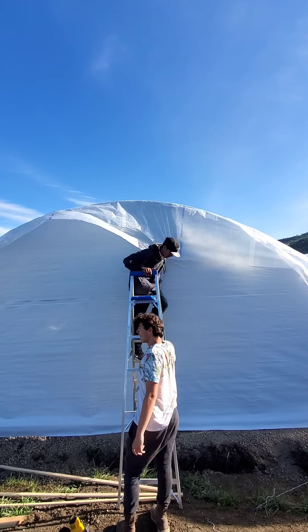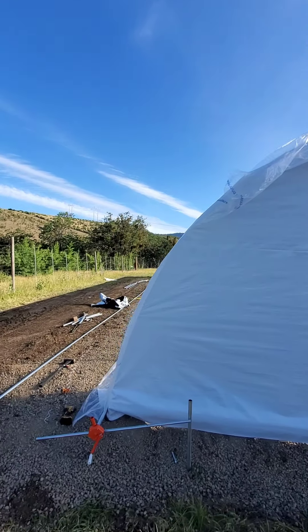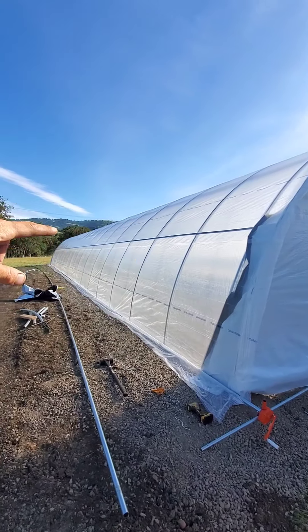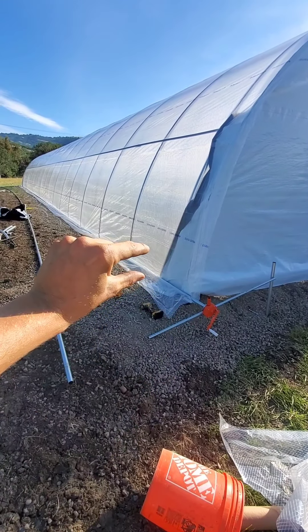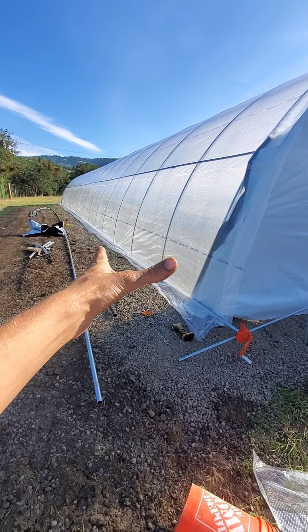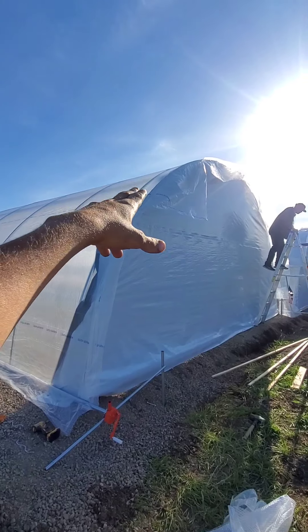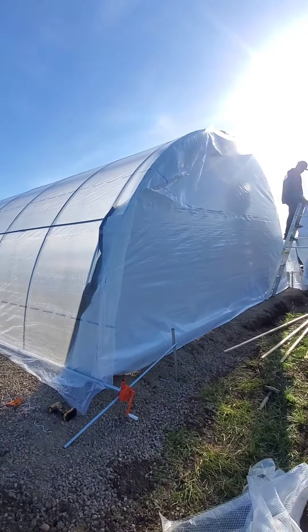Right now I have just the final wiggle wiring over the tops. After the tops are done, we will then run the side wiggle on both sides. I like to hook my roll-up sides and roll them up two or three inches on each side so it pulls it tight and taut so you don't have any slack up top. Before you put those sides up, you want to wiggle wire each up-and-over hoop on each end of the greenhouse.